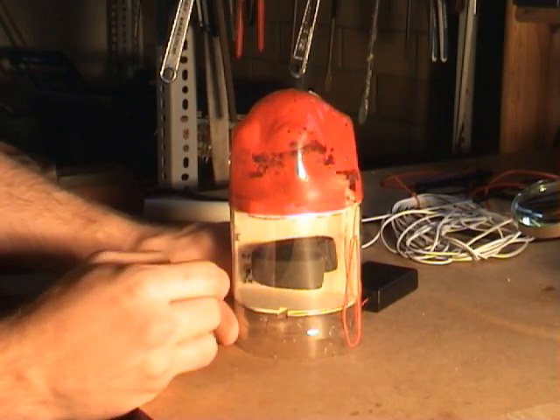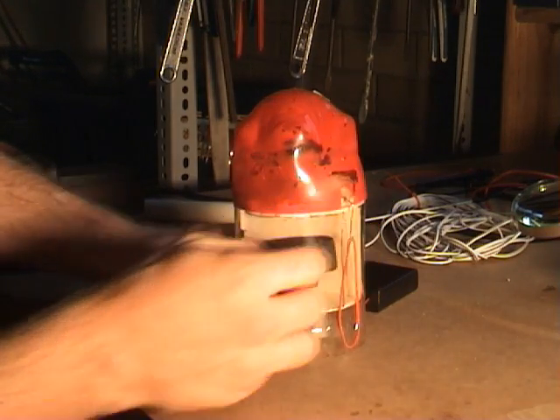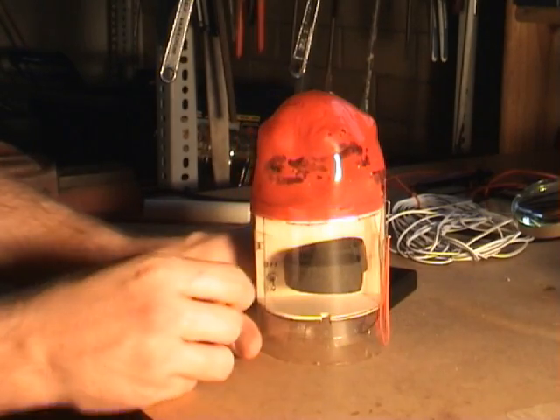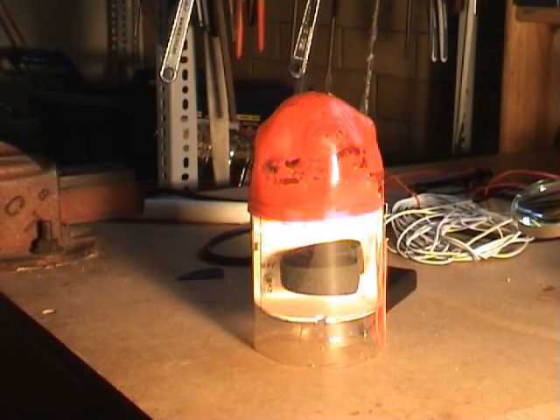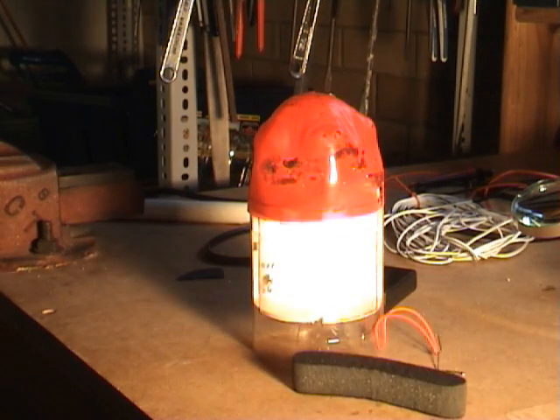So if we put this in place and lock the clip in place, flick it down there — what we have to do is press the arming button. The servo inside sets itself, fires, knocks the pin out of place, and the parachute flies out.